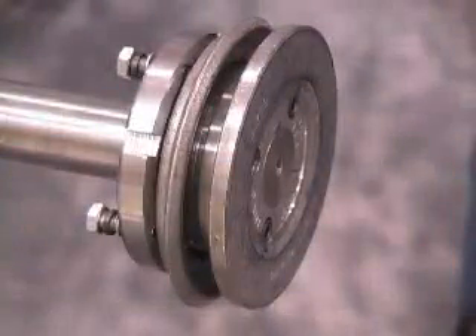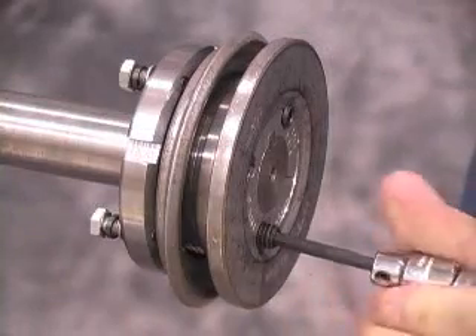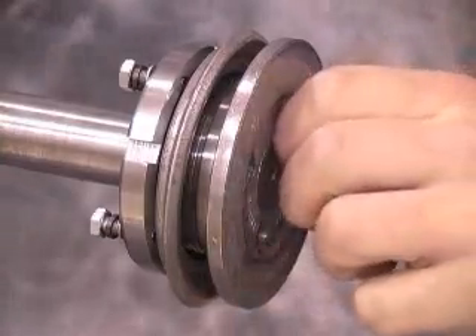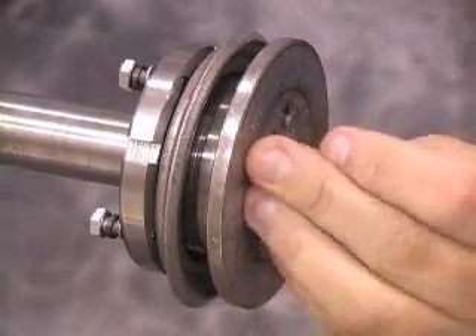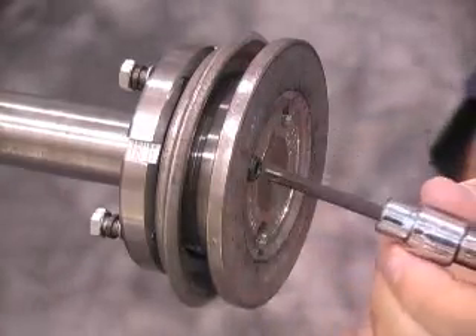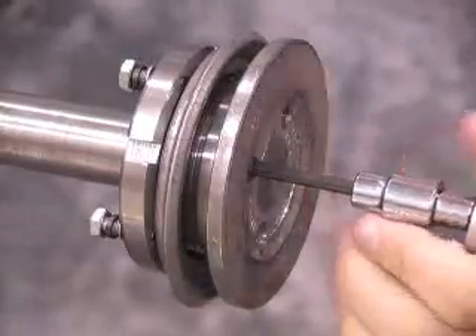Let's take a look at how to remove the taper lock flange. To dismount the taper lock style hub, begin by removing all of the set screws from the bushing and flange. Place one of the set screws into the dismounting hole, which is the hole threaded on the bushing side. Tighten that set screw until the assembly comes loose from the shaft. Remove the flange from the shaft.